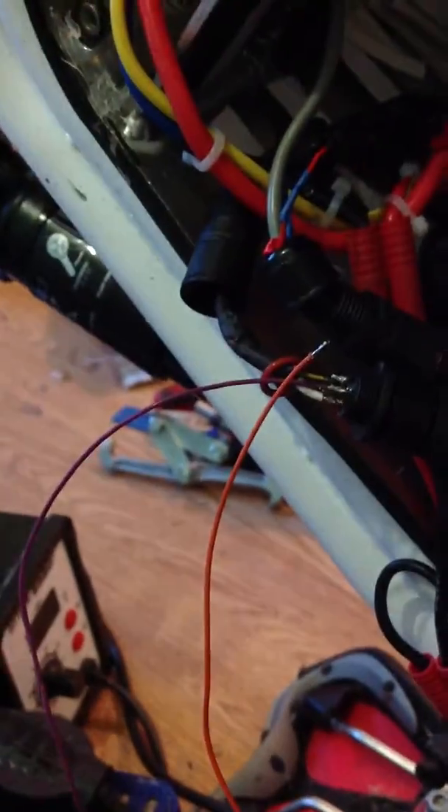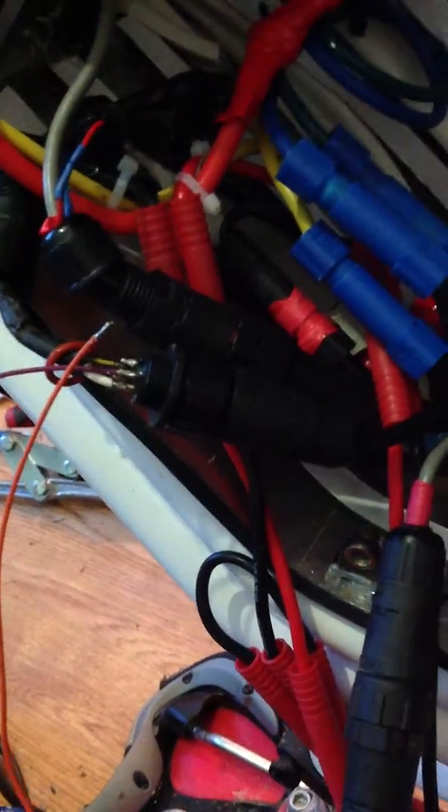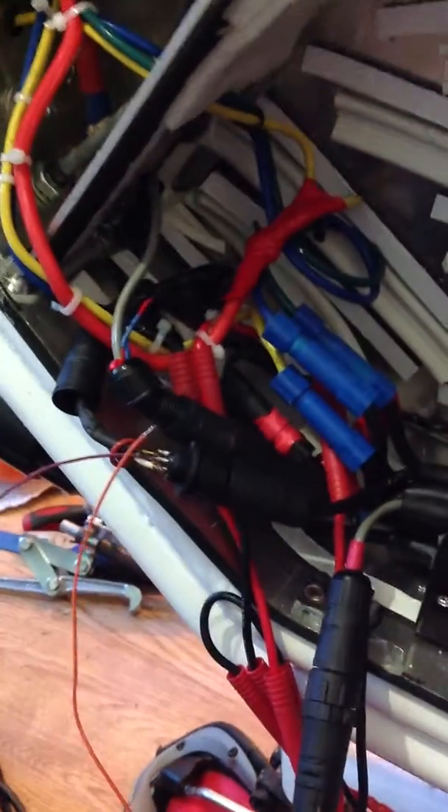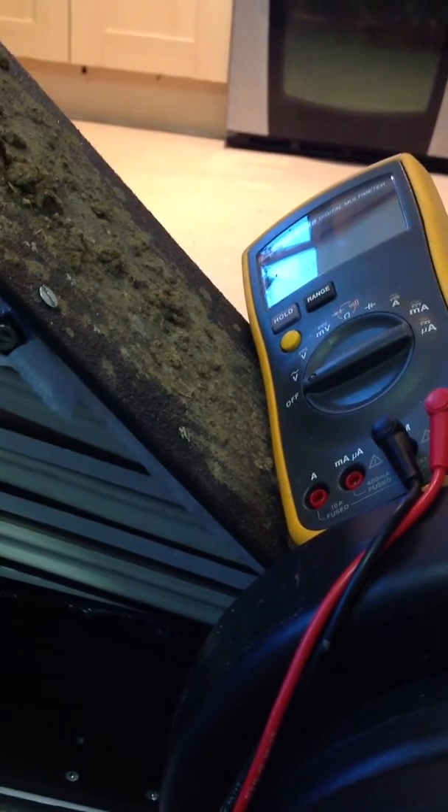That feed goes to the motor but not to the other end going into the controller, because I don't want it forcing its way into the controller — the power needs to go to the motor and the controller will deal with the rest. I've also linked a ground to make sure they're both using the same common ground, hooked into the earth connector. They're not disconnected from the motor so they're all using the same ground. It's passed all the auto setup and the circuit tester says 4.90 volts, so it's getting the right voltage now.